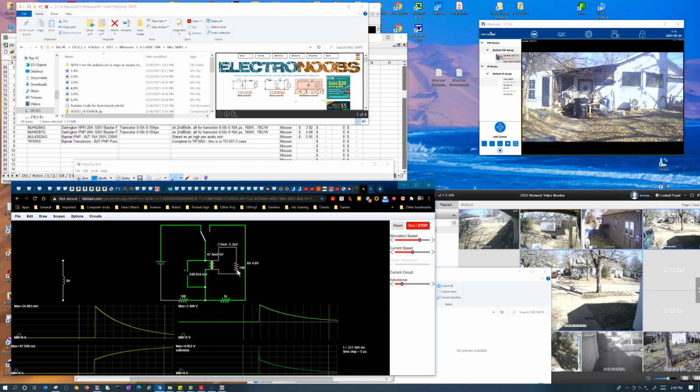So it's like it's treating it like a transformer resistive load at first. But then it starts treating it like an inductor after it hits 25 milliamps for some reason. And what I'm suspecting is that the 25 milliamp figure is probably a balance between this and this. That's my theory, assuming this is a real phenomenon I'm looking at. That's why I trust this thing less, because it's probably set up to treat these transformers as a power transformer, instead of something unusual, which is kind of what I'm doing with it. So it may not simulate this stuff properly, so I may not be seeing reality here.